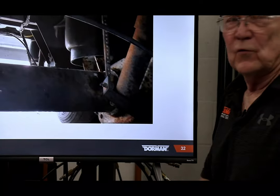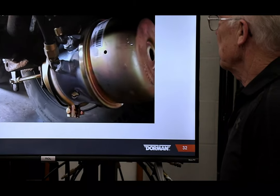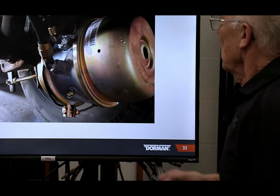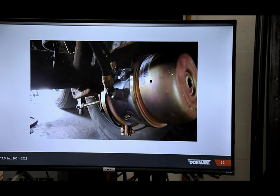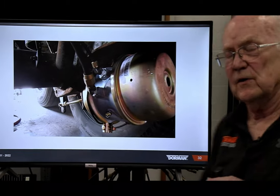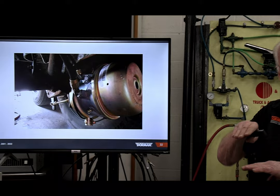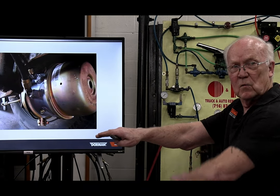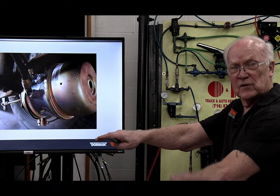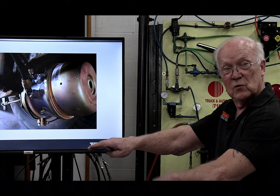And I'll walk you through this, I'll tell you exactly what happened. When you go into Federal Motor Vehicle Safety Standards, you get into hoses, it'll tell you that the hoses have to be flexible. If you, for example, just think about it, you got the axle, this is my chassis and the axle is here. The axle moves, right? Okay, chambers are fixed to the axle, so now you need them to be flexible,